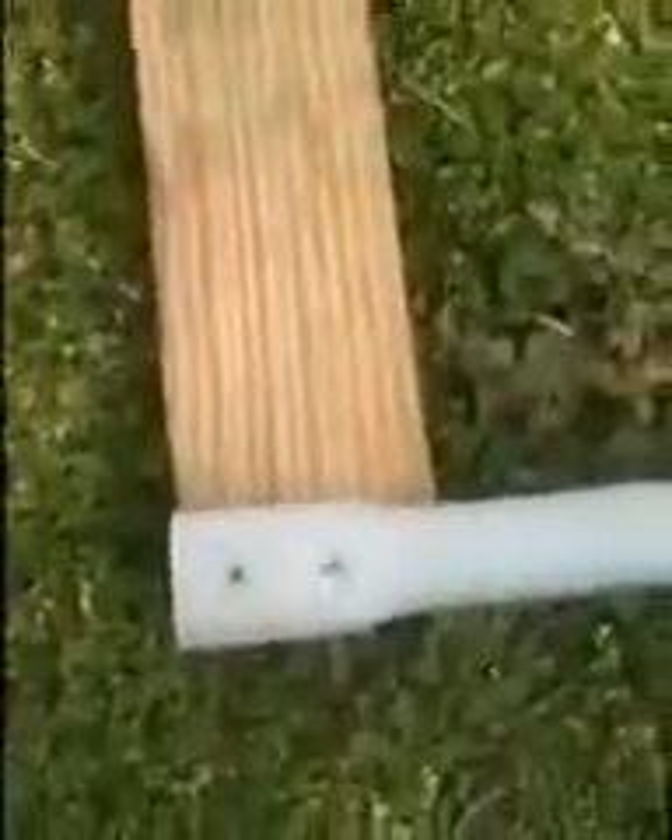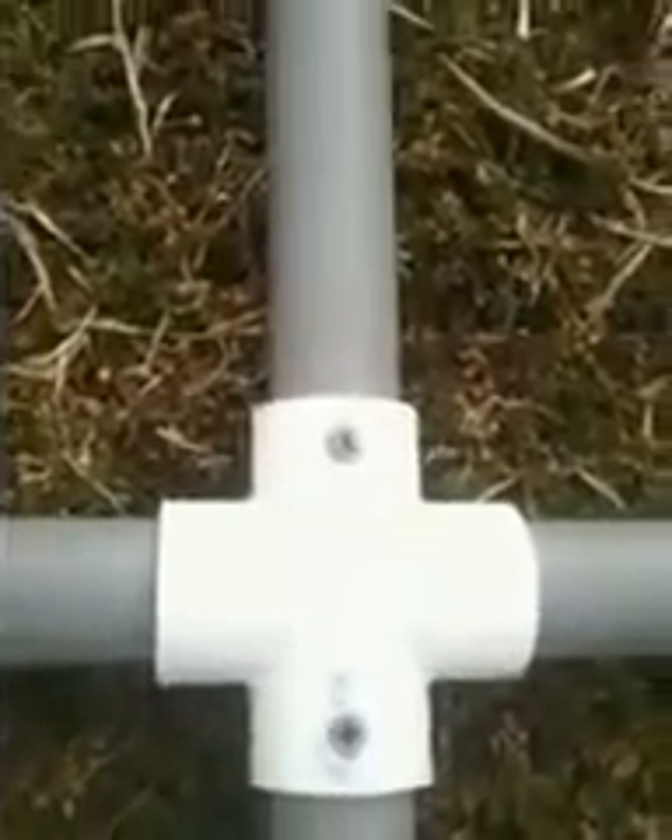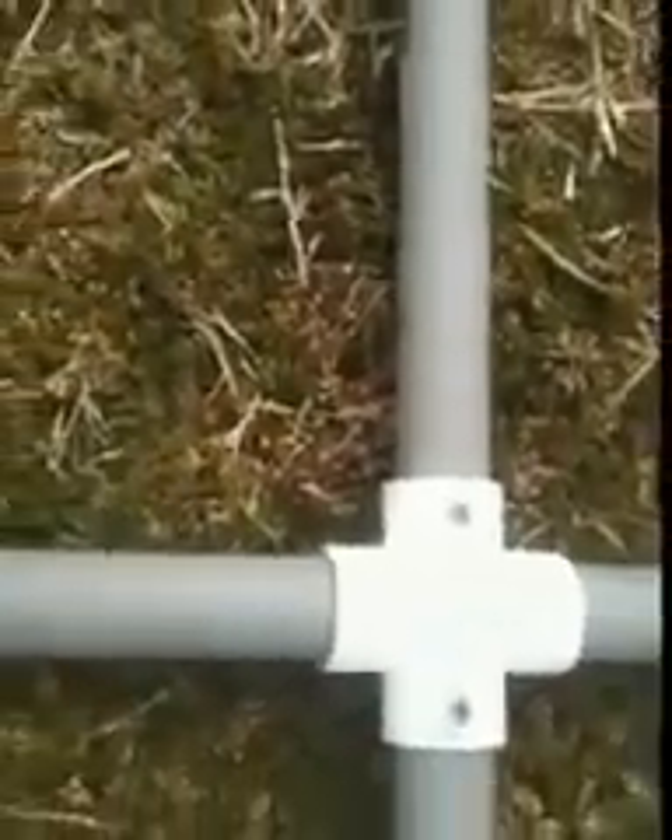Let me give you a little briefing of where we're at. What we've done here is put two screws all the way down and attached that — two screws at the end, three-inch screws. I've got all these attached. That's a before and that's an after — put two screws in there so it ensures they're going to stay put. We've run our center pieces down. And last but not least, remember this metal pipe? He's nestled in there now — and that'll give our roof a lot of support. So here in a second we're going to go and put it up.